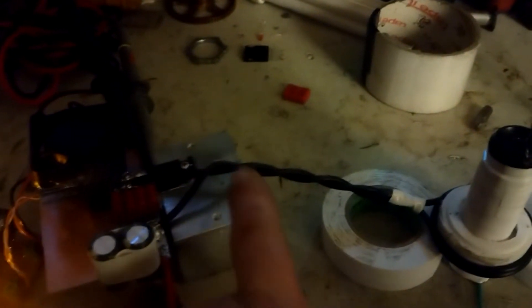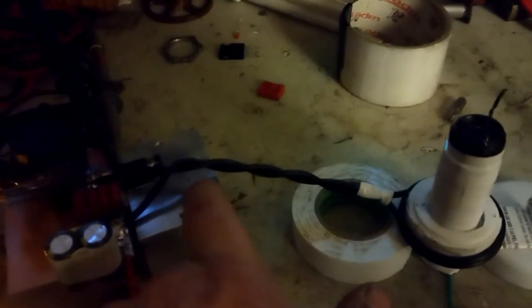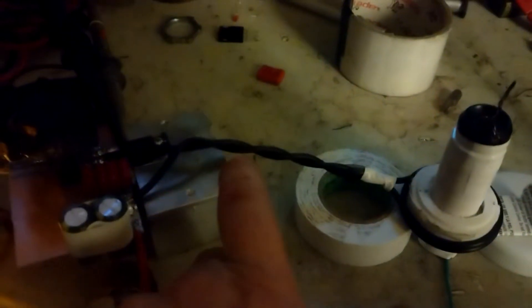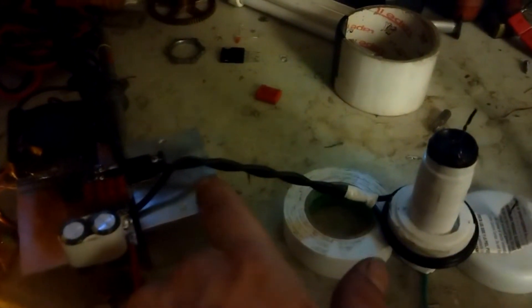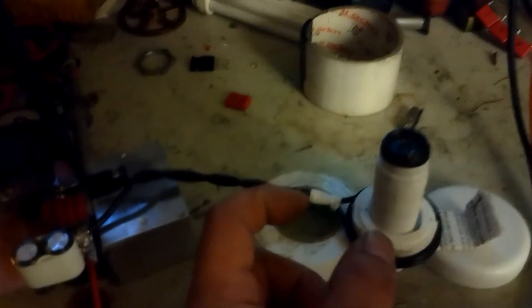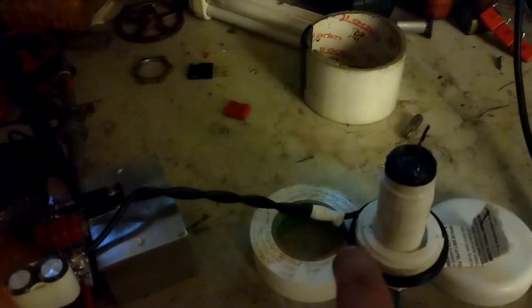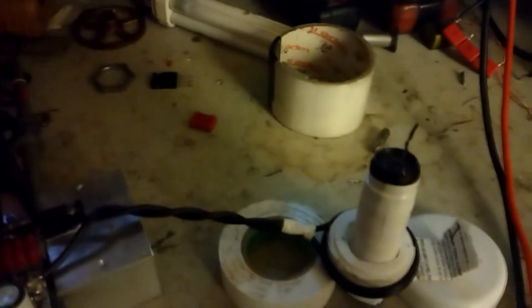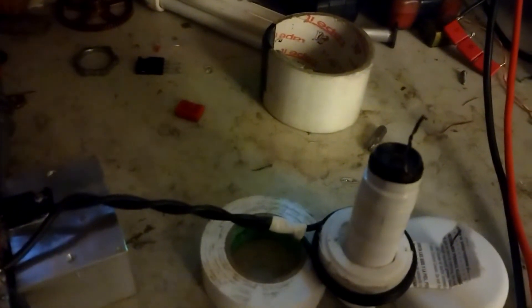I've got quite a bit of length of wire here. I started out running much shorter wire — like one turn, real thick wire, made it real short — and then kept backing the cap size down on the shunt to see how high a frequency I could get the LC running at. It seemed like the shorter I made the wire, the higher I tried to bring the frequency, the more ringing I would see in the switching. I probably have sort of a max on this setup that I'm going to be able to run and still manage the switching without it being too bad, because I can't make it super super short — it just wasn't working out. This length actually liked it a little bit more.